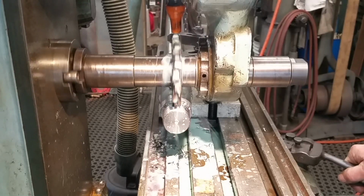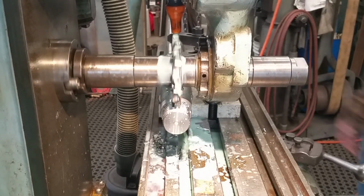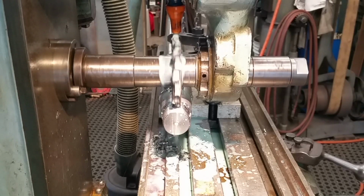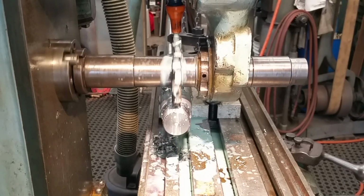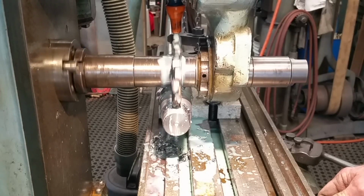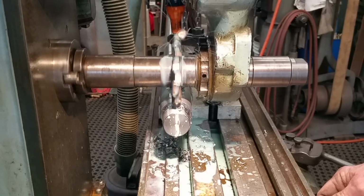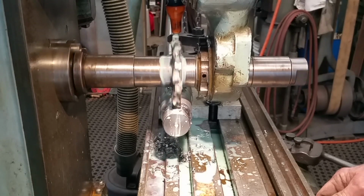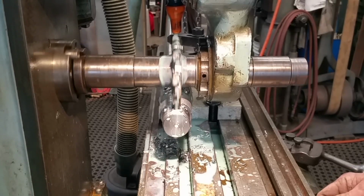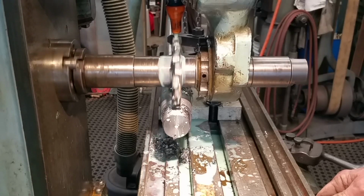Okay, there's full depth. We're going to engage the feed now. We're going to give it just a little bit more coolant in here. Doesn't sound bad. That's pretty much what Aquamet 22 sounds like when it's being cut with the wheel cutter. My arbor bar runs within a couple of thousandths, so some of that might be the pitch difference you hear. But in between that, you can hear pretty much a load on each tooth that is formed.